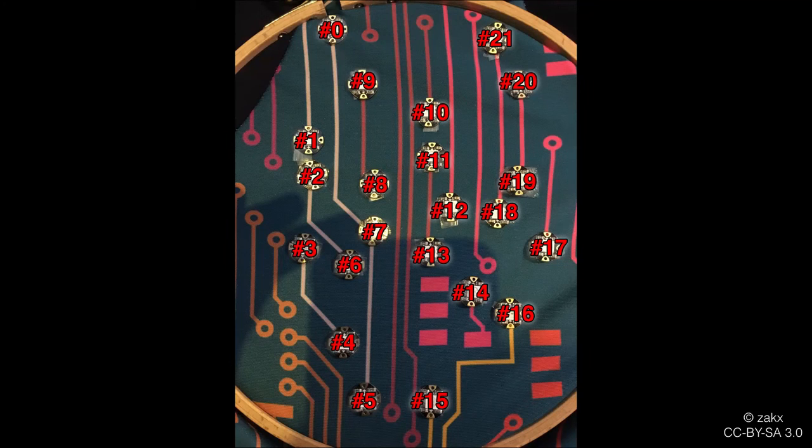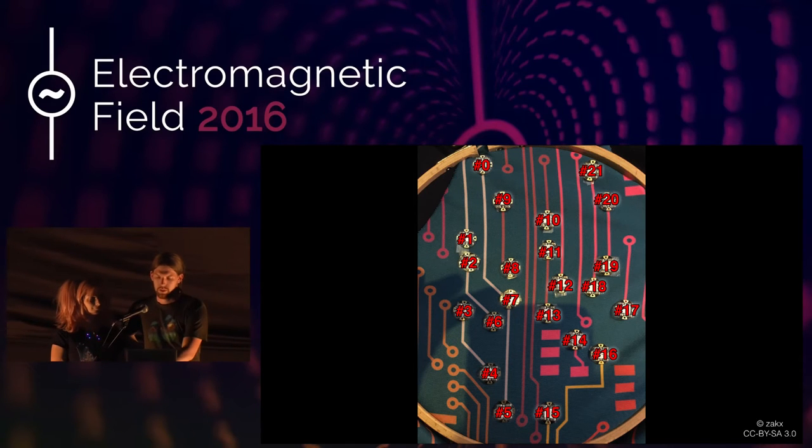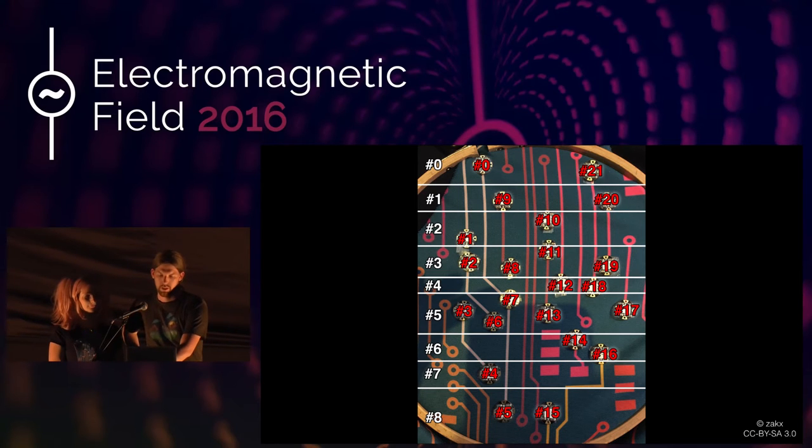And if you have a complex pattern, where you want the top to be addressed as a single virtual pixel group, you have to actually do some mapping in software. So basically, if you have an arrangement for your LEDs, you can probably address them from the library like this. It starts at the top with zero and then goes on in the direction they are actually connected to each other. But what we need for this kind of project is something like that.